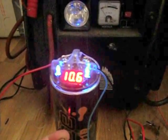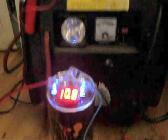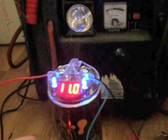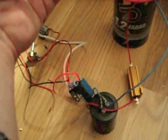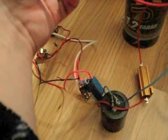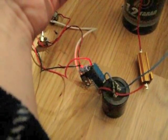Although that digital display itself takes quite a bit of power, so it might not even get there. I've left it a bit late. But nonetheless, it's slowly getting there. I'll carry on explaining. The circuit takes the power at optimum load for the solar panel and converts it to a higher current at a lower voltage. And the circuit is simply a switching voltage regulator where the feedback is on the solar panel side, not the output side.